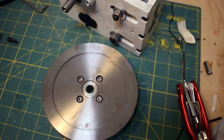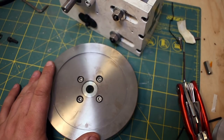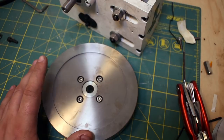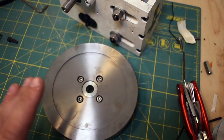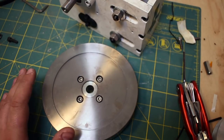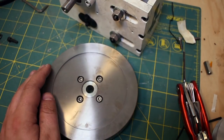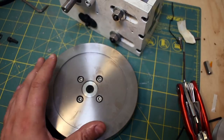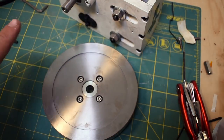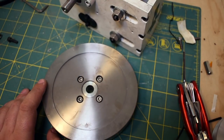The material was really, really bad, although I've since heard some really good tips from commenters. Some people said to use higher quality weights. I guess some weights are made with steel instead of cast iron. And then also weights that don't have cutouts in them, because the cutout is sort of an anomaly in the casting process, and it's much more likely to generate voids. So I may revisit that again someday. This piece of steel was like $15 or $20, I think. So it wasn't really that expensive, although, as you can imagine, getting bigger and bigger, you start getting way more expensive. So it still may make sense to try exercise weights for flywheels.